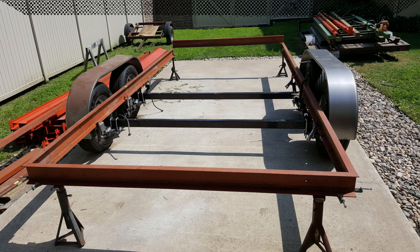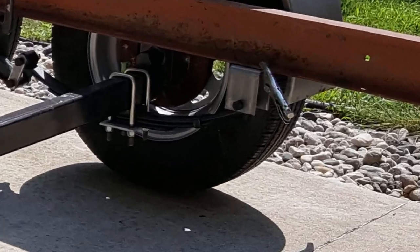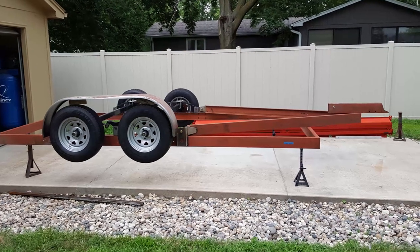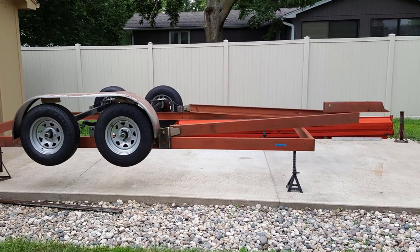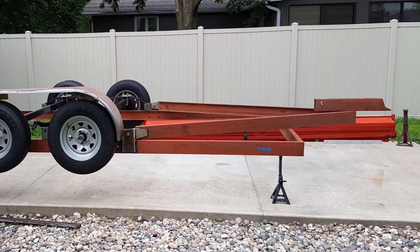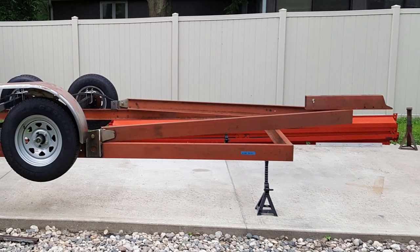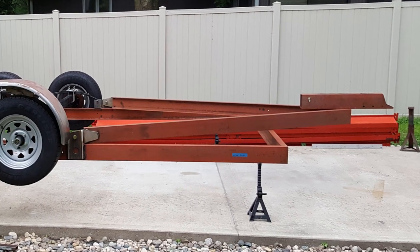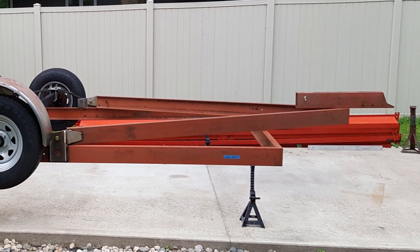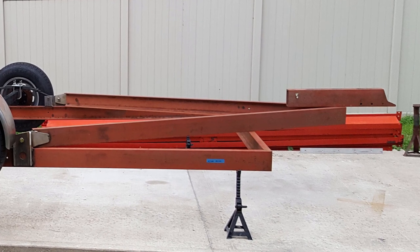Few different angles of what was going on. Everything's just held together with clamps and vise grips at this point. And finally, things are tacked together a little bit in this picture. Kind of ignore that fender sitting there. That was just to get a reference to make sure things were still going in the direction I anticipated. The main frame's been tacked together. I didn't mention these are 102-inch wide axles, so we ended up with an 80-inch wide bed, and a 14-foot length of the bed.